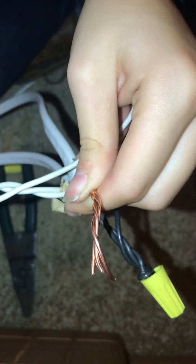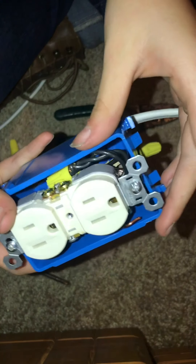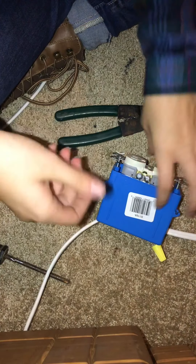Now we're doing the exact same thing with the ground wires — struggling to twist them together and line them up for the wire nut. Add your extra wire to make the pigtail, have them all nicely lined up, then wire-nut those until they are tight. Then make a loop with the other end of the ground wire and screw that in on the green screw. Just like the switch, push all those wires inside so it looks neat on the outside — and there's your perfectly good plug to charge your phone. I placed a disclaimer: if you burn your house down from this tutorial, it is not my fault. Thank you for watching!